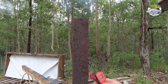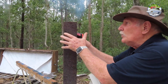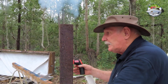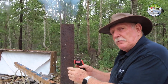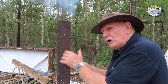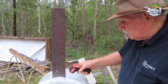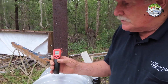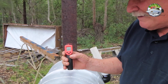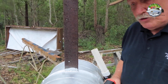Our plan is to put another water sleeve around here. We'll make it work like a rocket stove so that the gases have to come back down and go up to get out. We'll get double heating — from the inside of this jacket we're going to put on, and also the outside of the jacket will collect all the heat. That's working really well. Right at the top here: 222 degrees Fahrenheit, or 105 degrees Celsius — that's over boiling point for water.